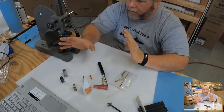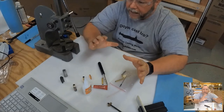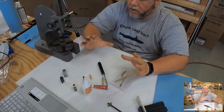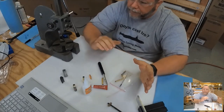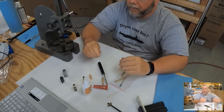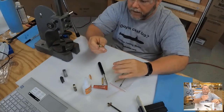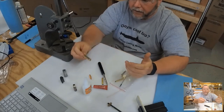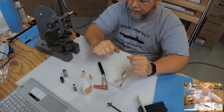Here's the chain of events: I'm going to go to my buffing station and buff a casing. I use 308 casings — it's a 30-caliber, a little shorter than the 30-06, and I like the look of it better. Then I'll go from the buffing station to my lathe, where I'll use a collet chuck and drill out the back of the casing so it'll accept the seven-millimeter tube, then press in the transmission.